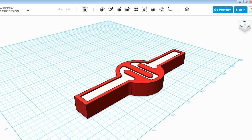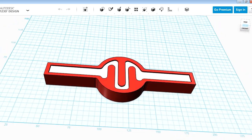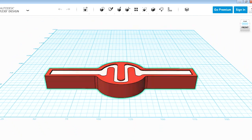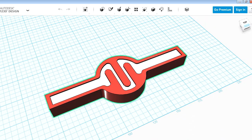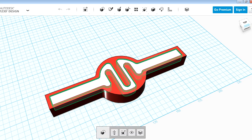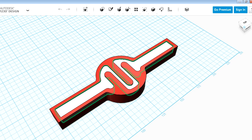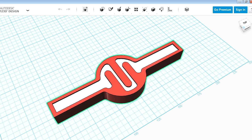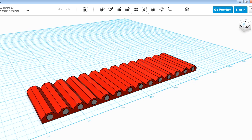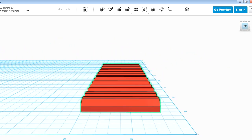Here's another piece I had an idea for — a hybrid print where the white is rigid and the red is flexible. We've got a kind of joint: a bendy piece of plastic but the whole thing is encapsulated in rubber. The bottom is completely covered in rubber — I've left the white ABS showing so you can see it — but the whole thing is made in one print, so the outside appearance could be rubber with a rigid plastic inside. You could use this for a robotic joint, some kind of shock absorber, or a toy joint. The second piece is a tank track or conveyor belt: the red flexible part goes around rollers, and the white rigid pieces stop it bending in the opposite direction.